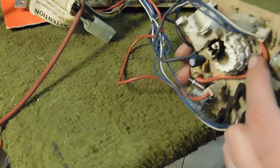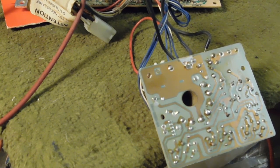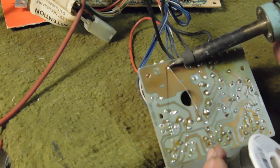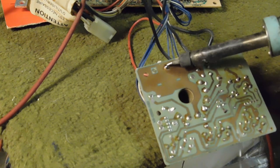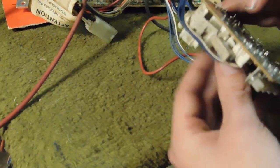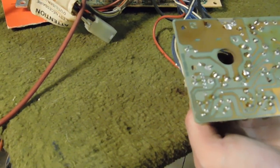Now that all those legs are cut, the next step is to liquefy that ground pin. To save time, I'm going to add a little bit of fresh solder to the iron because this is all ground right here. In all reality we need a lot of heat to make this thing melt properly, so get some fresh solder on there to make it easier to melt. It's kind of a pain because we're talking about a ground plane here. Now I'll grab hold of the socket on the opposite side and while I heat this up, I'll carefully wiggle it off. Oh — it just popped right off, perfect.